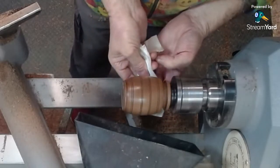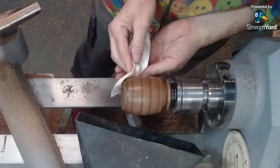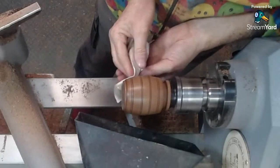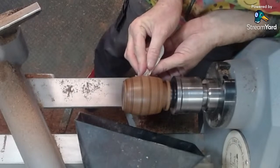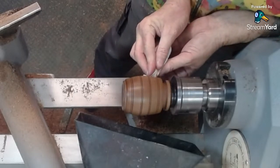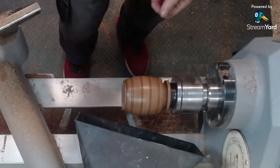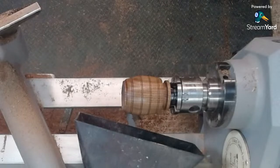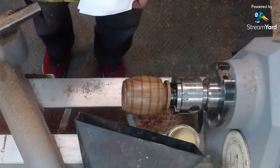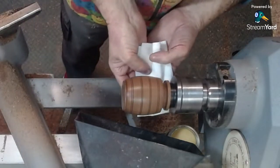That grit has actually worked very quickly. The grooves there, is it? It's worked very quickly. So you don't have to get out the grooves, just put a bit of tissue on your nail and run it around and it's back out again. I'd say that's also because it's walnut. It just polishes, it cuts, everything it does well. And there's its own oil in it. It likes it, don't it? It comes up lovely. Turn the speed up. Give it a quick buff with the Yorkshire grit on it first.